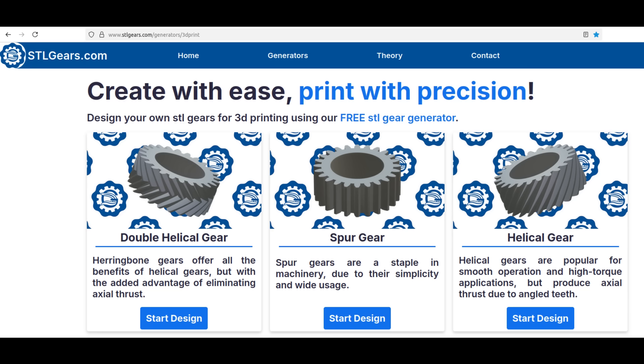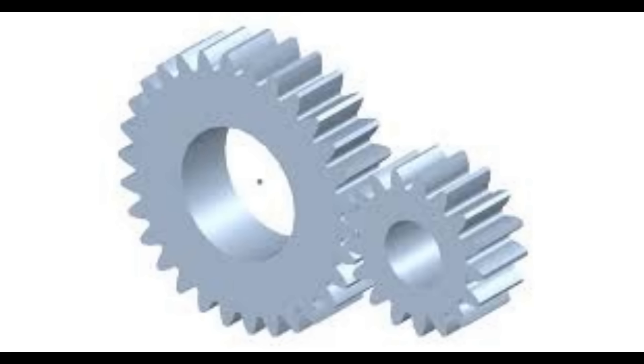A double helical gear is just a single helical gear chopped in half, flipped around, and joined up so it makes a chevron. Although you can make these, it can be a little tedious. Another option is to use a gear generator, of which there are quite a few, but the best one I found really usable is one that's simple and free to use. When you download it you can get it in SVG or DXF, and all you do is enter the parameters - the modulus and number of teeth - to get a gear really easily.